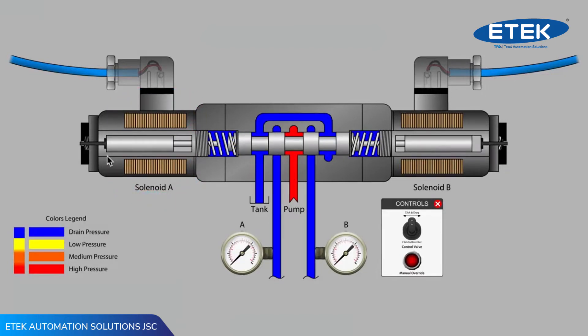Let's start all over again. Before energizing solenoid A, observe that the left armature has been moved all the way left in the valve tube and a gap is present between the push pin on the left side of the spool. When we energize solenoid A, the armature and push pin get a running start against the spool as this gap is closed.